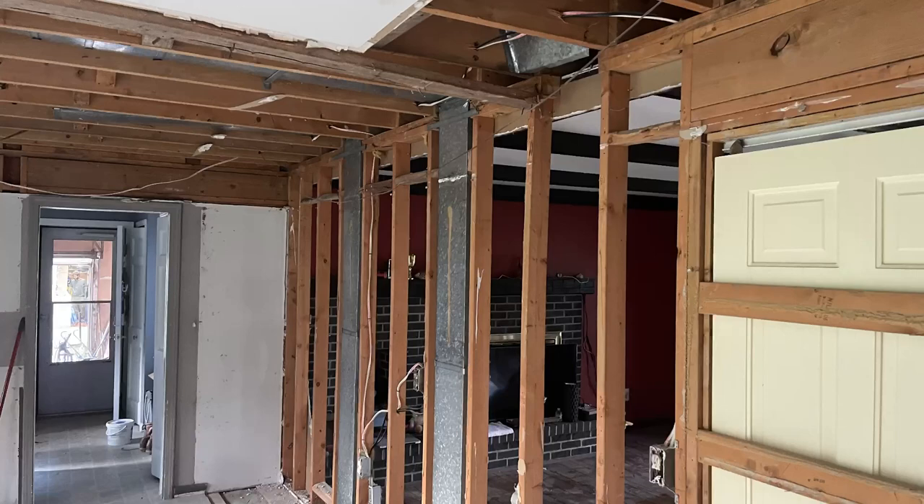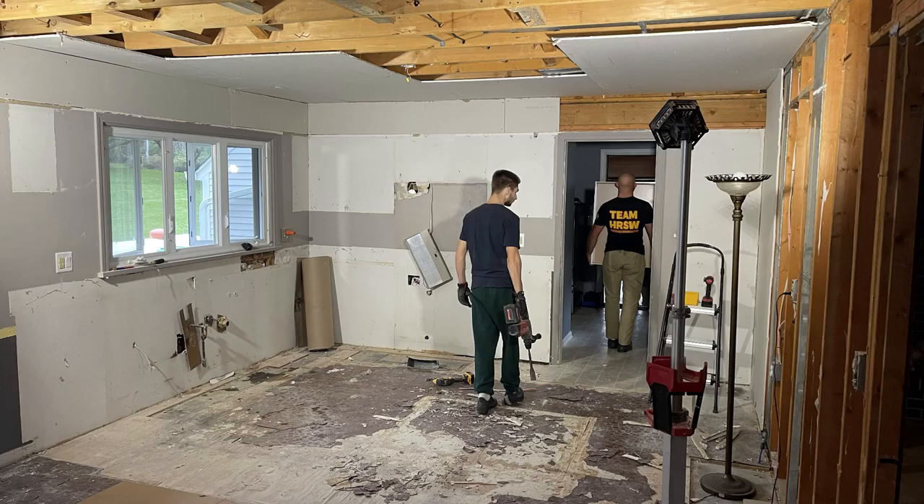We're demoing all the floor and I'll be throwing in some pictures of what it looked like before. We've got two load-bearing walls — one long one, and another stacked on top of it. That's a total of 30 linear feet of load-bearing beams being installed: 18 feet and 12 feet, so a total of 30 feet.